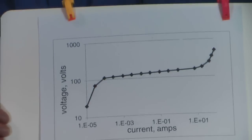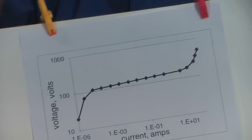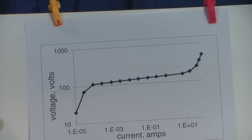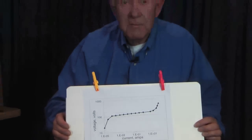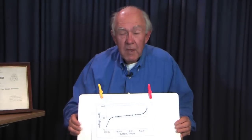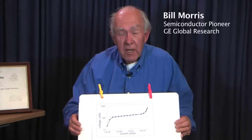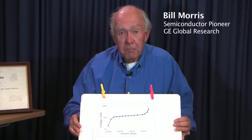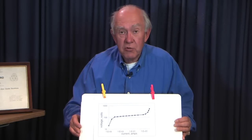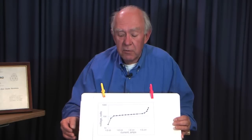The transients in circuits are generally very short in time duration. A 60 hertz cycle goes 16 milliseconds per cycle. The transients you see will frequently be less than a millisecond, and sometimes they'll be down around the tens of microseconds range. That's still enough to puncture through insulation and damage components just as well as a steady-state voltage.